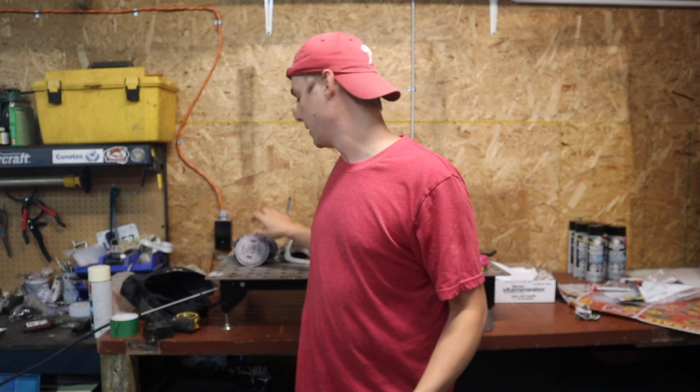Today's video I'm going to be talking about respirators. I've got a couple different types I'm going to go over, and before I get into the respirators I'm going to explain why you should be wearing one. When you're welding there's a bunch of different fumes and scenarios where you should have a respirator on. There's a lot of heavy metals once you get out of mild steel into stainless and other alloys. There's a lot of stuff in there that once you breathe in it's never getting out of your body — it's toxic, cancerous stuff. You need the respirator to protect you somewhat from that; it's not a hundred percent but at least it helps.